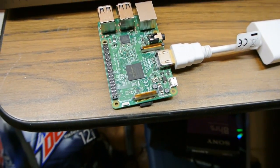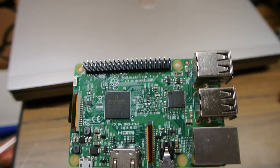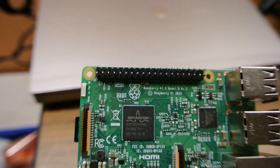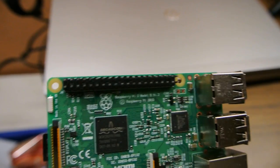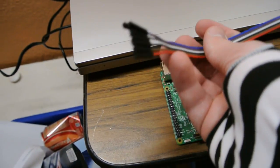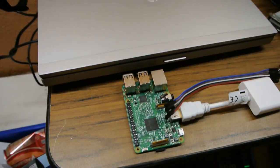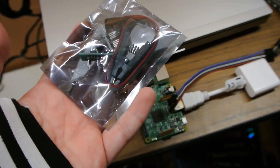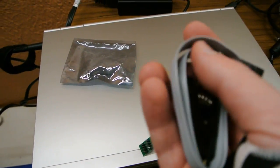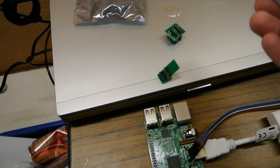So I'm going to show you exactly what you need. The first thing you're going to need is a Raspberry Pi or a clone — stuff like the Orange Pi or Banana Pi will work too. All you need is the GPIO pins, which have the required connections to hook up the flash chip. Second, you'll need a bunch of female-to-female jumper wires. Third, you'll need the BIOS flasher clip, which clips directly onto the chip itself, and then plugs into the Pi using the jumper wires.